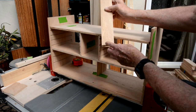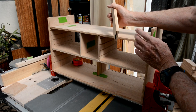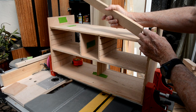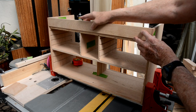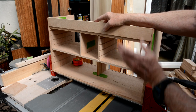I've got to make these dados again — rabbet joints. The drawings just have you do a butt joint and put some brads in; the brads are hidden by the corner hardware. I kind of prefer doing a rabbet joint so that it's a little more solid — a little more work, but I think in the end it'll make a nicer project.